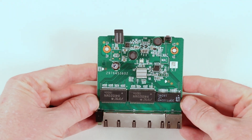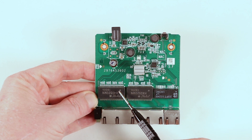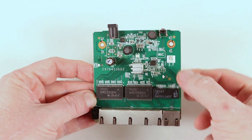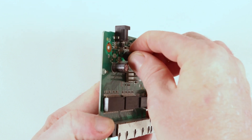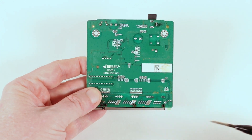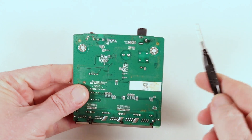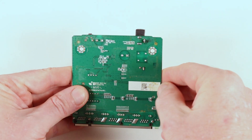Fairly standard printed circuit board. From looking up the manufacturer's codes, these are actually only rated 10/100 — they're not gigabit capable, not specified at gigabit. They're just little decoupling transformers to take off any nastiness that happens to hit the ports. The capacitors have a nice plastic or rubberized coating on them. The back of the board looks nicely laid out. There is a little bit of nastiness just here — this socket was probably soldered in after the fact. You can see they've held that iron on there a bit too long and scorched the board.